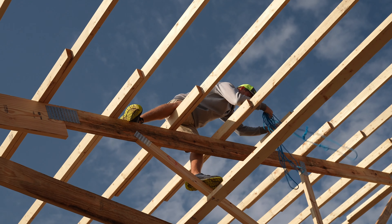So to recap: step one, plumb the walls; step two, straighten the eave; step three, square the peak; step four, straighten the end fascia. That is this straightening video — hopefully you guys enjoyed it and that's what you wanted because you asked for it. If you did enjoy it, hit that thumbs up. If you want to see this entire build, I'm going to put out a full time-lapse build of this 40 by 60 shop, so look for that, subscribe so you don't miss it, and we'll catch you guys on the next video.